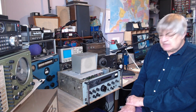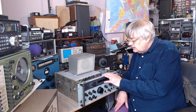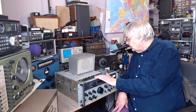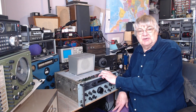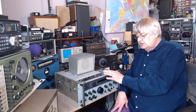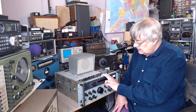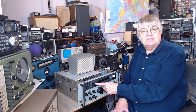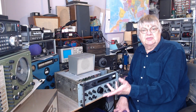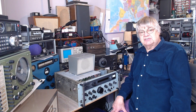Sort of mid-seventies, weren't they? It wasn't only the switches — there were various other problems. Some of the wiring needed sorting out. A couple of solder joints had gone bad; I've resoldered those. Lots of fiddly bits — it wasn't just a case of cleaning switches and it worked. For example, the disc here where it reads out the megahertz — that didn't go around properly with the control knob. So it says you're on five megs and you're on 13 megs, next time you come around it says you're on 15 megs. So there was a lot to sort out.